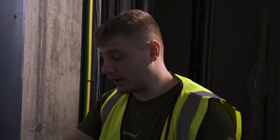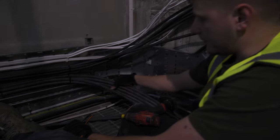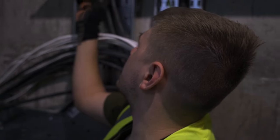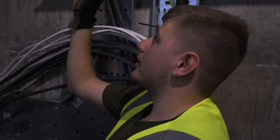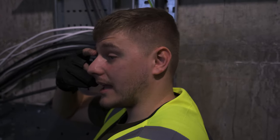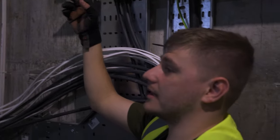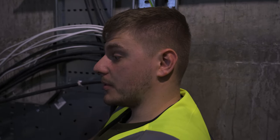All in all, I think it went pretty well. Now I'm going to start getting these armours in. What we've got is five 10-mils on the bottom and five 4-mils on the top. I'm actually going to rejig these — put the 10-mils in the middle and the 4-mils on the bottom. We've got two 20-mil holes done already for the site temps, and then I'm going to drill four more holes, so that'll be six in total. We only actually need five, but I'll do the sixth because we've marked it out — makes the next electrician's life easier, or maybe Gaz's later in the job if an extra cable needs to go in. If not, we just put a bung in it. I'm drilling these out, and I'll need to rejig the other six because they were made for 20-mils and we're going to be using 25-mil glands.